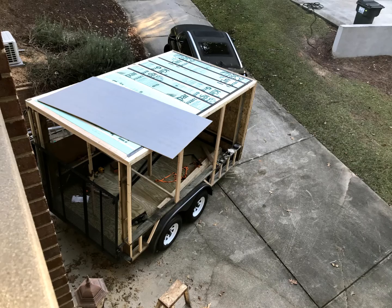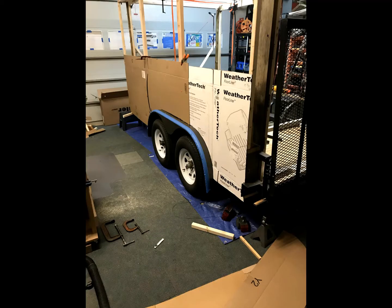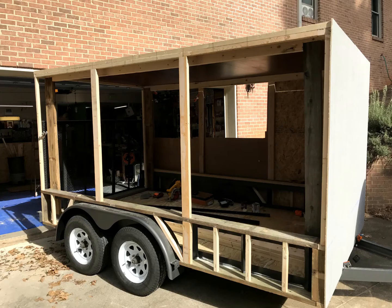Once the insulation was cut and wedged into place between the 2x2 rafters, my wife and I taped the seams to make it all airtight before gluing and screwing down the roofing panels. Once glued and screwed, it was caulked and 3 coats of deck primer sealer was applied. I bought the deck primer sealer solid stain from Home Depot as an oops bargain for $30 for 5 gallons. I created the cardboard templates to go around the wheel wells and frame the sides at 16 inches on center. As I said, the exterior paneling was glued and screwed to the framing.